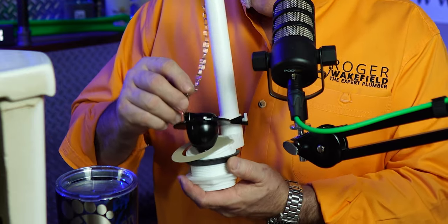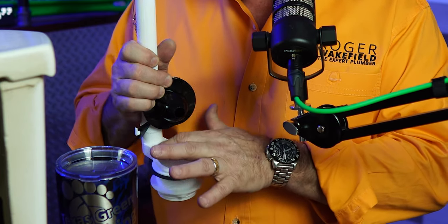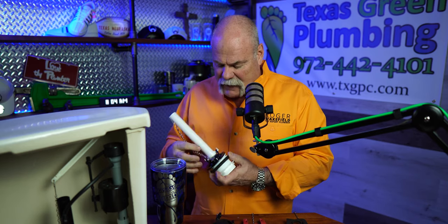This is the entire flapper valve assembly. The flapper — the black rubber part — is the part you're actually going to replace. In the middle of replacing it, reach down and feel the seal, because if it's cracked, nicked, worn out, or anything like that, changing your flapper isn't going to help. If you've got too much chlorine in your water, chances are the flapper is going to feel real soft and rubbery, almost like cotton candy. If it's black, you may want to wear gloves because you'll get that chlorine-eaten black rubber all over your fingers and it doesn't come out easy.